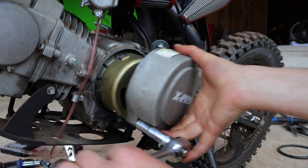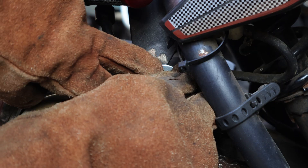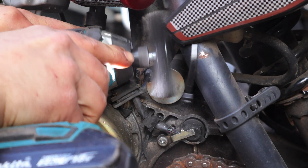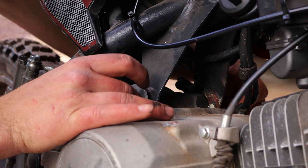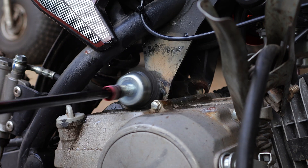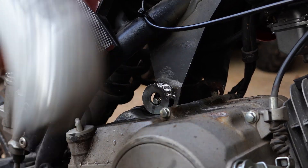In this case, we aren't going to weld a lot, so hooking it up to a 120V outlet will work just fine. I'll start by cleaning off the paint, which as you saw earlier will lead to a better overall weld. I'll position the washer and give it a tack weld. Since I absolutely don't want the weld to burn through, I'll briefly pause the weld to let the metal cool down a little. As I'm brushing the metal to prepare it for paint, I have to be very careful not to rip the wires. I'll do the other side as well. A crucial step to prevent rust, which will compromise the metal strength over time, is to apply one or two coats of primer and paint-in-one spray paint after cleaning the slag off the weld.